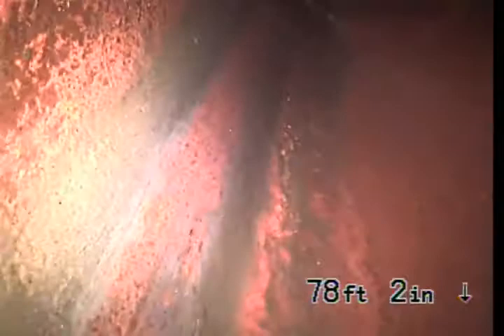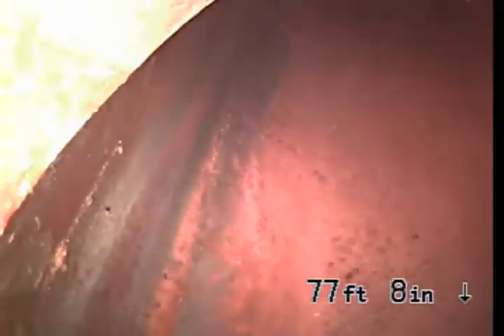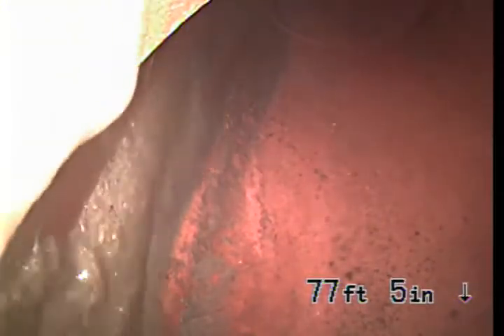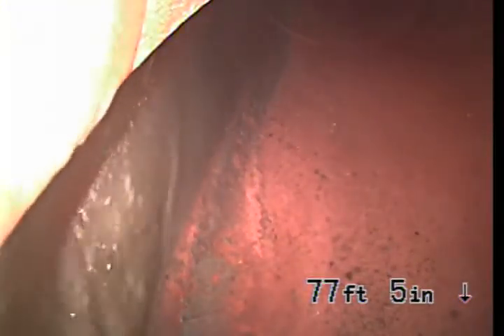A little bit of mortar right there. And here is our city connection. The sewer line is a total of 78 feet. We have original 6-inch and original 4-inch clay. We're going to recommend a small hydrojet just to remove the roots we saw at the beginning.